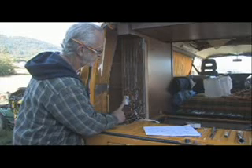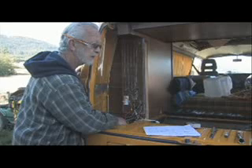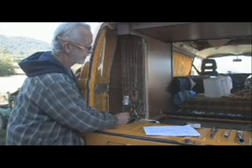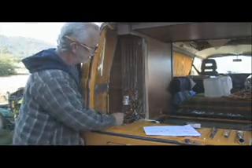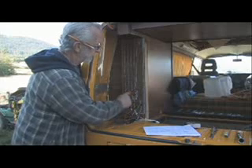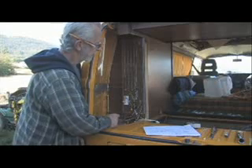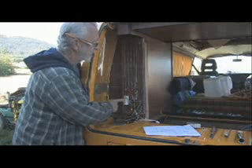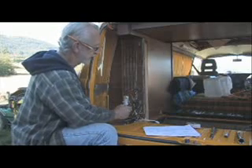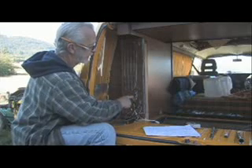We've got the positive side coming through the mod, and we've got a capacitor across the input. The positive side also goes directly to the engine block, so we've got 120 volts AC — or DC — directly to the engine block. This 120 volts DC is rectified through diodes on the ground leg. The ground leg is the one with the knot in it. It's buffered across the capacitor so that we eliminate the spaces in the negative — it's like eliminating the negative part of the sine wave. I have a fuse and a switch in here but I don't include those in the schematic.